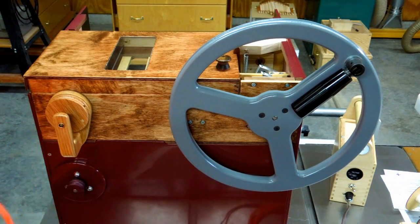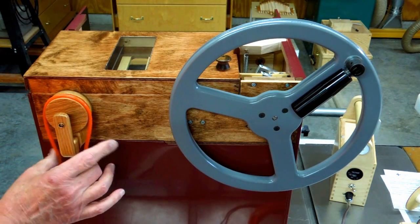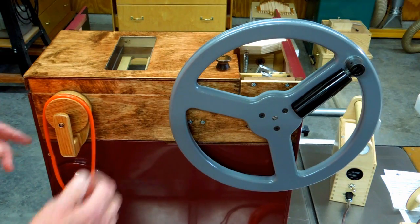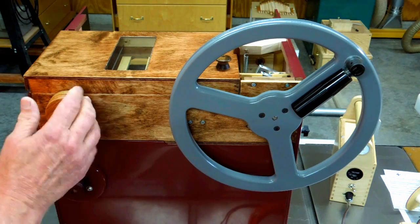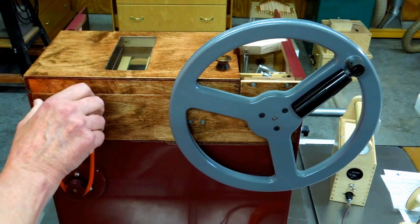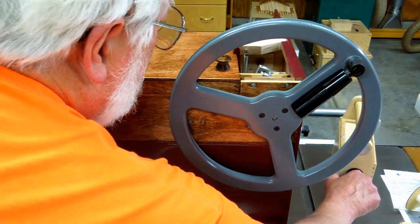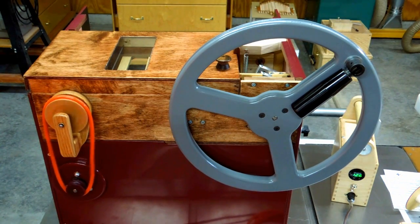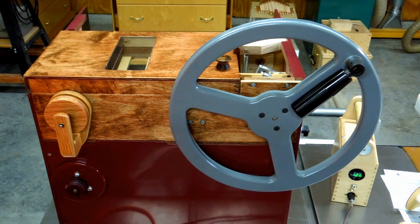The organ is not completed yet — I'm to the point where I need to start running some of this. You don't need to make these belts very tight; this material grips onto the pulley extremely well. I've changed this rewind mechanism for this organ — I am no longer making it so I can hand crank it. Just plug it in and turn on the battery. That's rewind. With this configuration it will actually rewind a little bit slower.